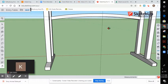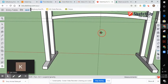All right. So with that being said, this might be a little bit easier to see here. I'm dealing with these three layout lines: top of mortise, bottom of mortise, and center. I'm going to come over here to my 2-point arc, and you got to make sure that you're right on that intersection or it won't work. Click one time here. I'm going to click one time there. Click one time there. That's in my center. Okay, so both ends and center.